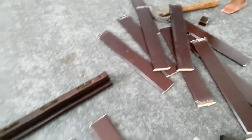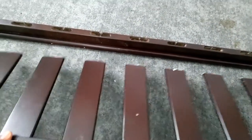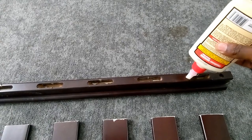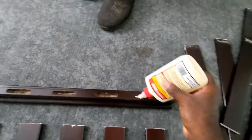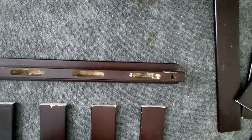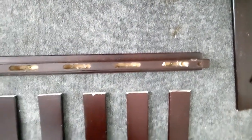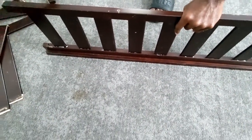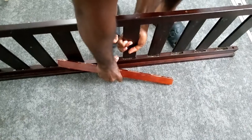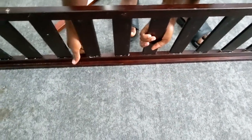Next I will be using glue to put everything back together, and that should be enough to hold everything tight. Just add some wood glue in all of those holes. After you add glue in all of those holes, start aligning everything together, make sure everything is in the slot, and then lightly start hammering on top of it to drive everything into place.